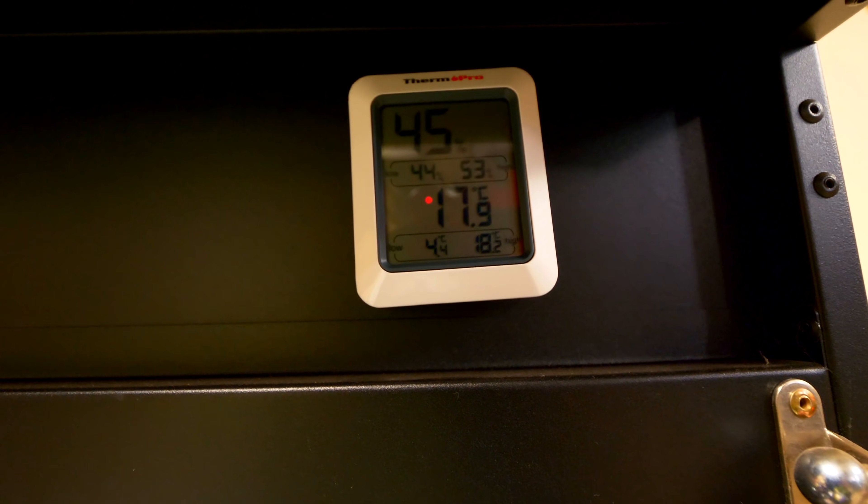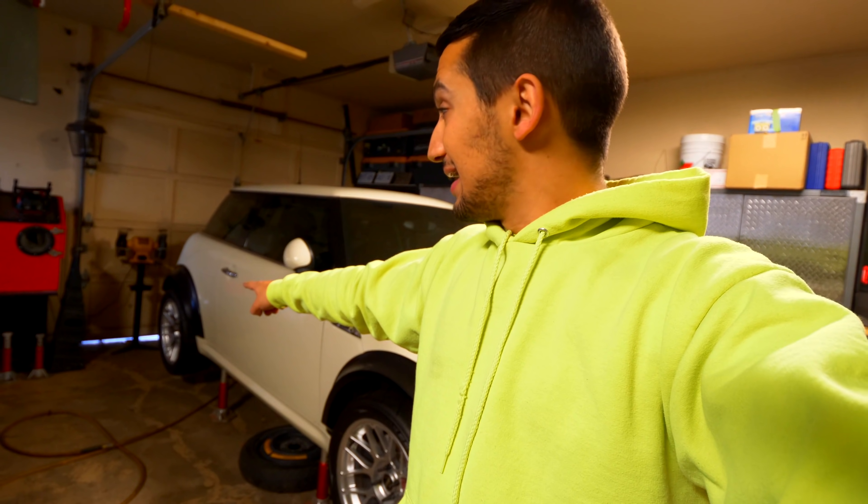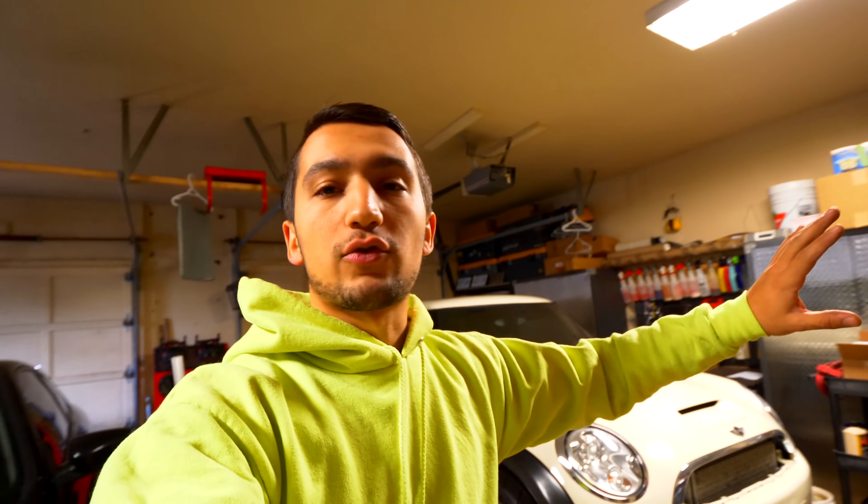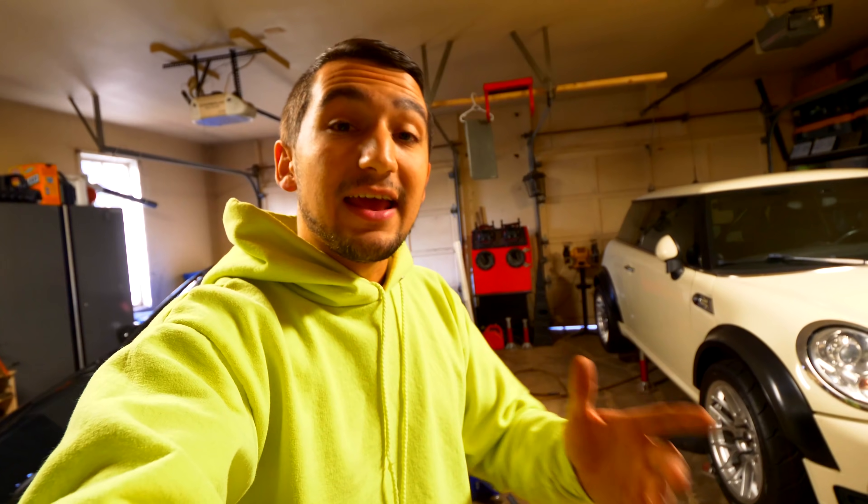Right now it's almost 18 degrees Celsius — I can basically take off my sweater and just chill out in the garage comfortably and work on my cars. If you really want to go crazy and make sure your garage maintains that temperature, if you can find someone with an infrared camera or even buy one, you can see wherever heat is escaping from. You'd be able to tell the bottom of the garage door has a leak, and you can see the cold and hot difference — cold areas show as blue and warm as red. But if you just take two seconds to go over all the doors, any hole you see, anything that leads outside, make sure it's pretty well sealed and you can't really see outside — then you're going to be in pretty good hands.